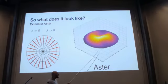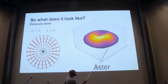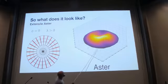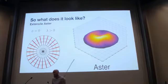Okay. And again, it kind of makes sense, right? The edge, this perimeter, now wants to stay exactly the same length. But in the middle, I should say radially, it wants to get longer, right? So now, in the distance between the middle and the edge, I've got loads of extra material I'm going to try and fit in, right? And in order to fit that in, it's going to pop out of the center.